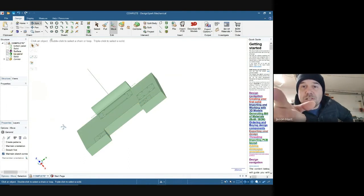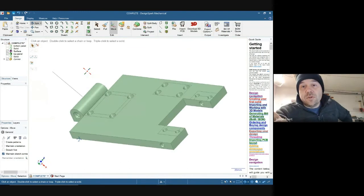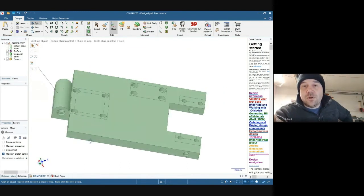Support that when it's standing up, which is, I mean, if you've got your driver steps dialed in pretty well on the printer, you don't have to have dissolvable supports or anything. You can get some pretty good supports that detach pretty easily, especially with PLA. But yeah, that would give you, for your important holes, like where your shaft needs to go at the joint there, a guarantee that it's perfectly round. You'd still have your holes that are going horizontally, but those are probably a lot less important.